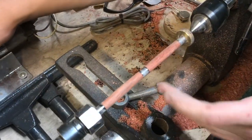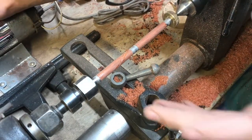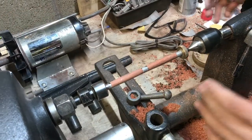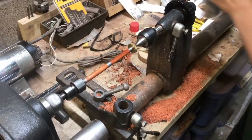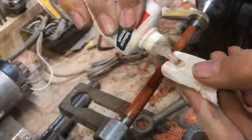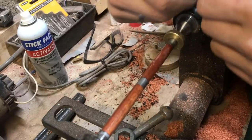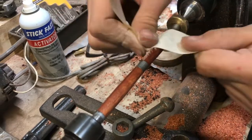This is good now. What I ended up doing was just flattening it. At some points I sanded through the finish, which isn't a problem at this stage — it's the first coat, so if you have a little spot where you sand through, we're going to be building up more layers. I'm definitely going to need to build up more layers because I had to take off more material than I wanted on this first one. So just make sure you apply thinner coats. There's still a few spots where it built up a little bit, but we're just going to sand those down and make sure everything is flat. Best case scenario I'd be able to start with 600, but I need to get this flat first.